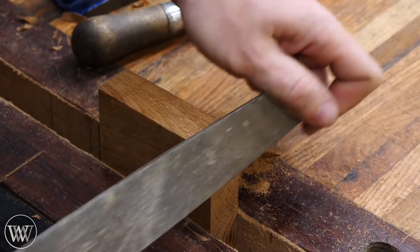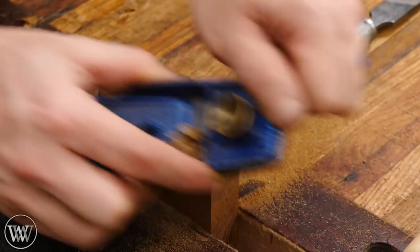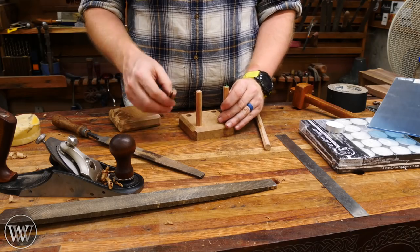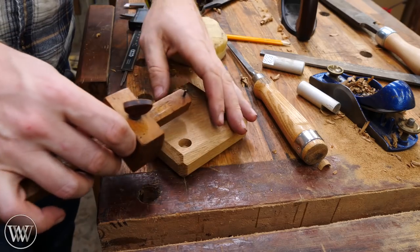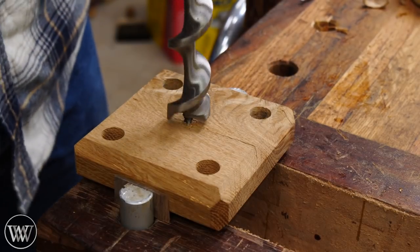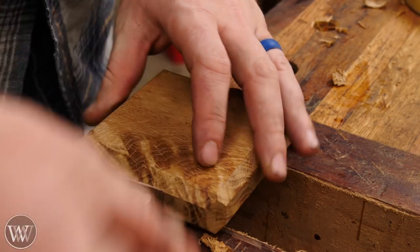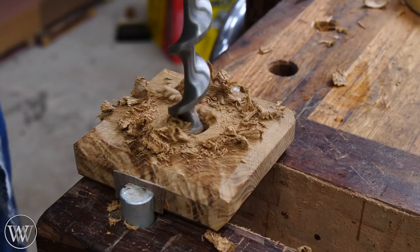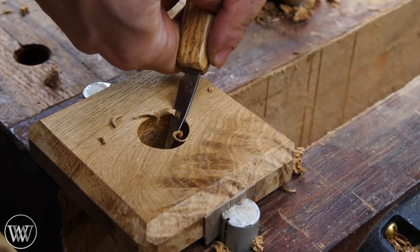Now before we glue this in, I want to make sure everything is smoothed and finalized, because once I glue it in I'm not going to be able to smooth the surfaces together. So I'm going to be putting a very heavy chamfer on all edges. For the top piece I'm putting a chamfer on both the top and bottom edge all the way around the block, and then on the bottom piece I'm just putting the chamfer on the top and corners. Then I need to drill a smoke hole in the top plate — this way the heat can actually escape the box as opposed to melting the plexiglass on the other side. I'm drilling a one-inch hole in the top. I bore through from one side until the auger bit comes out the bottom, use that hole to make a mark, put the auger bit in, and plunge through from the other side so the two lines meet up nicely. I want to clean up the top of it, smooth it out, give it a chamfer so it matches the outside — just do that with a knife.